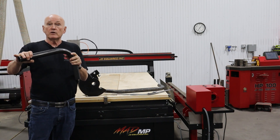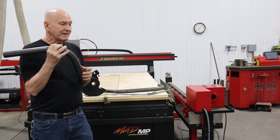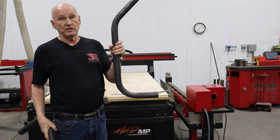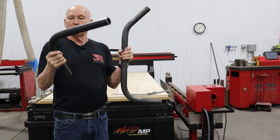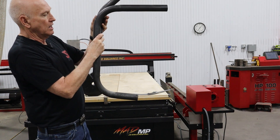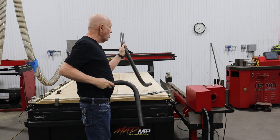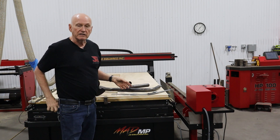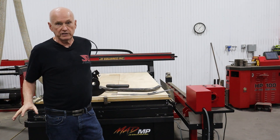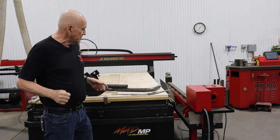Then make the 90-degree bend - you may bend a little more but you want roughly 90 degrees. Then if you have a piece of tube that needs a bend transferred onto it, you take your template, place it alongside, and slide the bend up and down until it's where you want the bend to be on the new tube. Then take a marker and put a mark on the new tube lined up with the line on the template - it works flawlessly. If you don't have a Bendicator, use this method - it's free, easy, and works great.